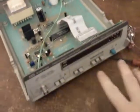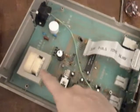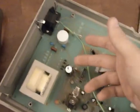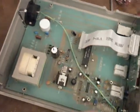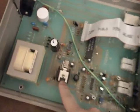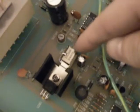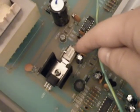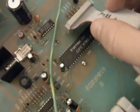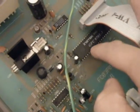Just to give you some orientation, here is the front again. Power obviously comes in through here, goes through the transformer. We have four diodes, so I imagine it's some type of bridge rectifier, and a smoothing capacitor. Here's an LM7805 5-volt voltage regulator. A 10 megahertz crystal right here, which is probably some sort of time base for the actual counter chip. Here's the main chip — this is a counter, and it's the primary logic of the board.